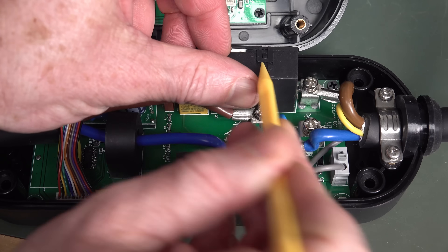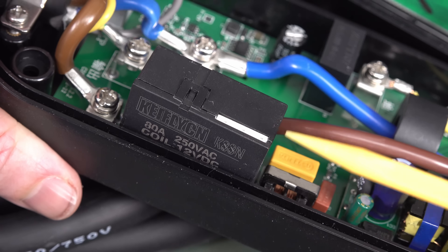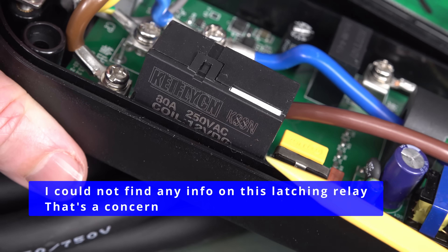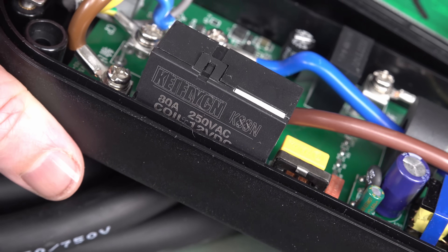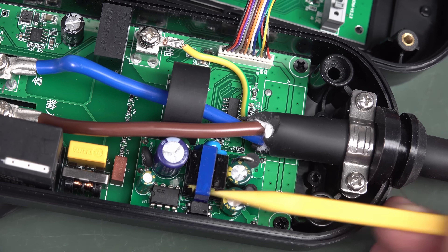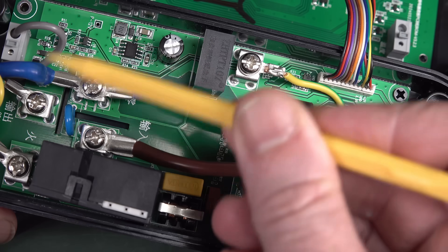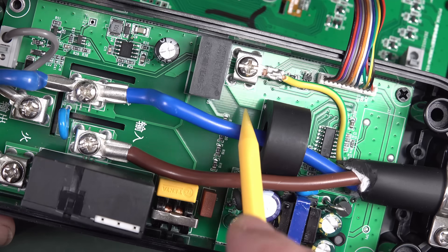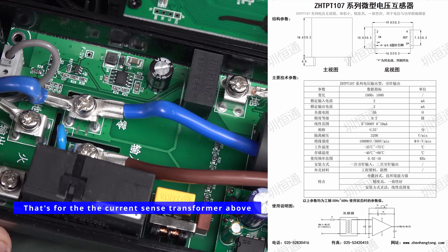There's a cover over the relay — it's almost like a protective case around it. I won't try to get that off because it looks like I'd break it. That's an 80 amp Radian relay — not a brand I know; it's not a Hongfa, which is traditionally used in a lot of EV charger designs like this. There's our power supply — an isolated converter for powering the electronics — with the ground running all the way around to the low side. And then we have a high-voltage series string of SMD resistors; they put them in series to get the high voltage since each one is only rated around 150–200 volts max.